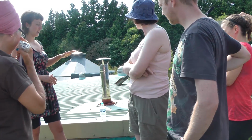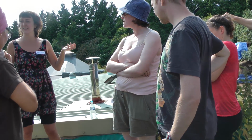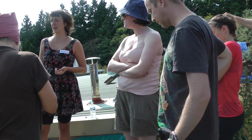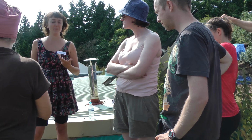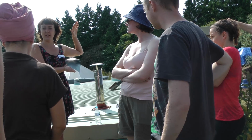And so if you have a flat roof in that scenario, then it means a lot more of the water's going to get evaporated instead of flowing down. So it's not really ideal for this climate to have a flat roof, or where most of your precipitation is rain. Also, I would rather have a pitch roof because you can have a second story here.